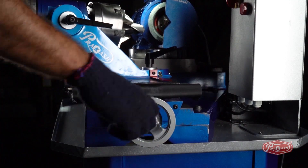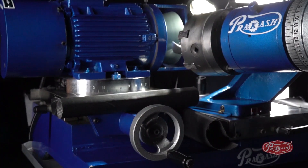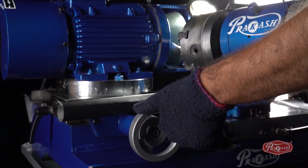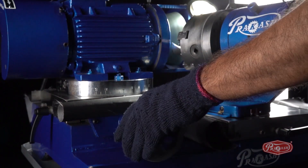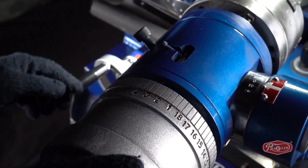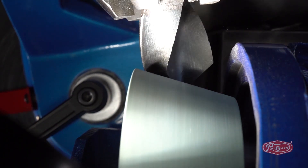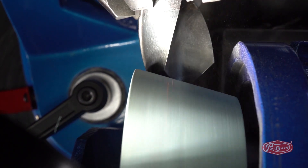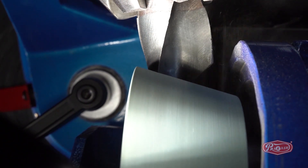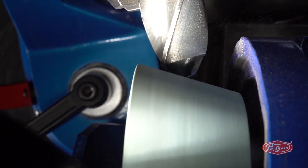Move the X and Y axis away from the green wheel and then start the machine. Now, using the X and Y axis, make the drill bit touch the diameter of the green wheel. Now, remove the spindle dial wheel pin which was set at number 3 to unlock it so that it can rotate freely. Keep rotating the spindle dial wheel in a clockwise direction and rotate the Y axis in graduals in an anti-clockwise direction to bring it closer as per requirement. This will bring the green wheel and the drill bit closer and back relief will be generated.